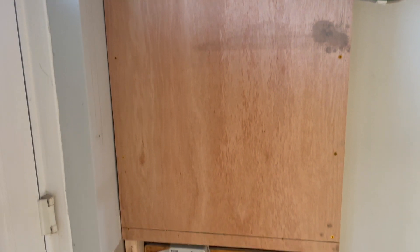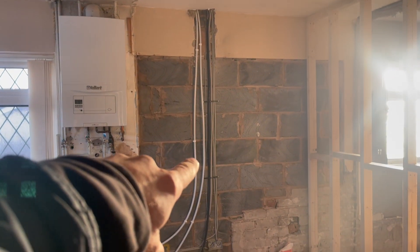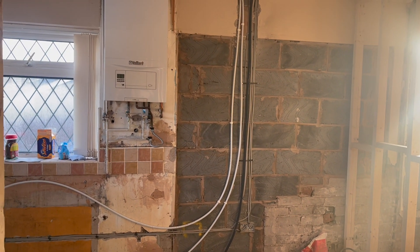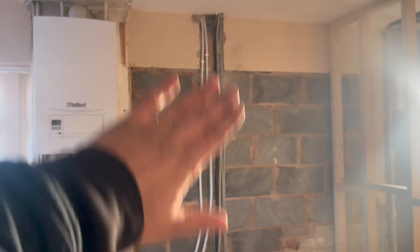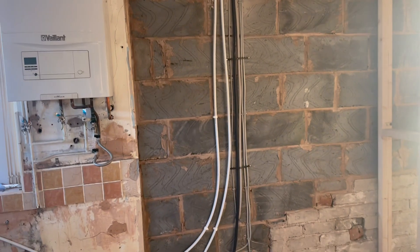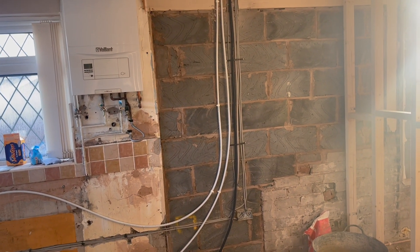Gateway is going there. Look at that nice piece of plywood. We've already ranged cable — took us five minutes. So yeah, Gateway, hopefully going below. I ain't spoke to the customer just yet, he's just turning up actually. I'll show you around first. We're going to drop the cable down here, as you can see, and then go straight out, get out back at the Powerwall, so you've got no cables showing. It looks really neat and tidy. I'm hoping this is going to be boxed out — if so, I can bring my DC cables inside as well. If it's going to be plasterboarded, I'm going to do it externally. Hopefully there's some boxing going in there, which will be quite nice.